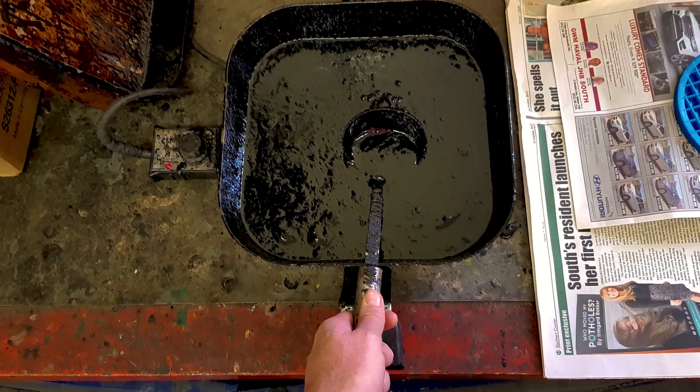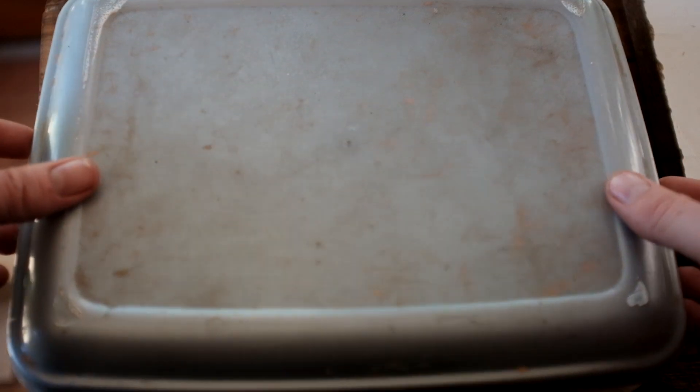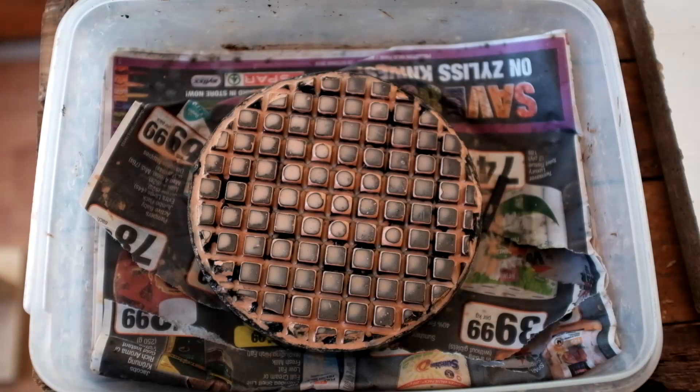We do this by taking pitch and heating it on your favourite fryer, then pouring it onto the other piece of glass that you were using to grind your mirror. You can either use a mould, or cut out some channels in the lap with a saw or knife. After pressing the mirror on top, this is what we're left with. Grab your buckets — now it's time to start polishing.